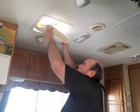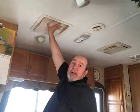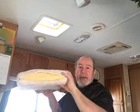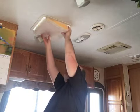So again, as heat rises, what I've done is I've purchased blankets, and these particular blankets are sold on the big box store and Amazon. And the blankets have removable covers for washing. And to get a careful, tight fit, I've actually removed the handle from the lift mechanism and set it on top so I can find it in the springtime when I need to remove them. I found this drastically reduces the heat loss into my ceiling area.